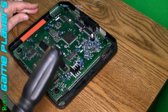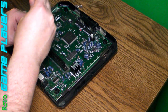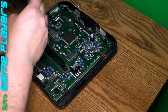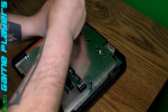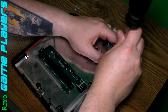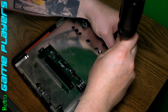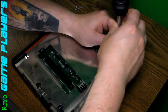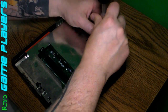Don't forget to put the cartridge slot screws back in first — those are the screws that hold the board to the plastic bottom piece. The I/O shield is technically not required. It's actually some kind of FCC device to help shield from interference — that's the whole point of it. So you can actually remove it, although I don't know if that affects airplanes flying around, radio stations, TV signals, or what the deal is.